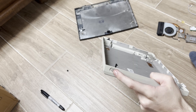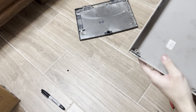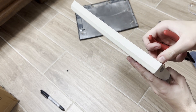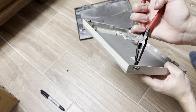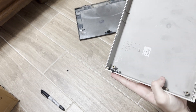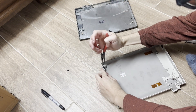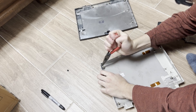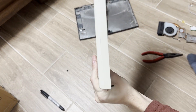Let's see how brittle these display latches are, since these always seem to break. I did try and see if there was a way to remove the latch to fix one of my other ones, but I can't figure out how to get it out. Let's see how tough it is to break one of these. Wow, that is bendy. I'm assuming this isn't ABS - it's probably a different type of plastic. That is very bendy and definitely not brittle. I bent it almost sideways and it's still intact. Here's a thinner bit of casing - I would definitely expect this to fully splinter if this plastic was brittle. And it's not - it's just deforming. You don't hear any cracking when I do this.